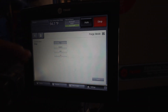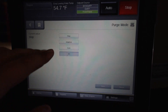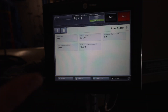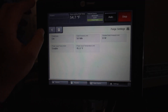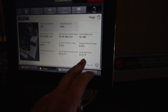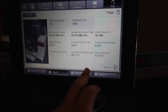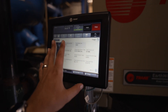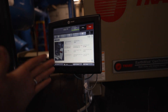When you're done, I recommend going ahead and putting the machine into an on and pump-out mode. We're going to save that before you open the valves back up, so that the little bit of atmosphere that gets in while you're servicing it has the ability to get removed from the system. It's also a good check to see if your purge is working properly, because your compressor suction temp ought to start taking a pretty hard nose dive with that much atmosphere inside the tank. Let it go through 30 minutes to an hour of purge cycle to pump out whatever atmosphere it's going to.